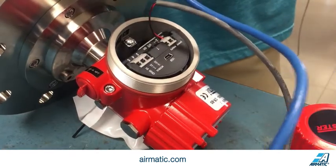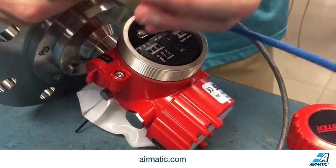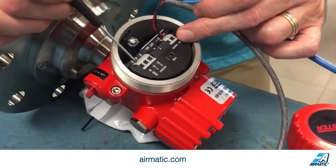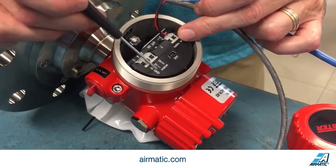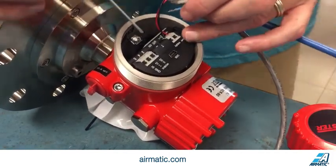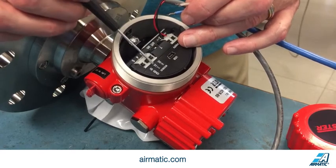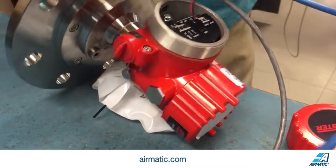This is my RS-485 cable. We recommend that the ground wire or the bare wire of the RS-485 cable is not connected to terminal number five. On this terminal block, you've got 3, 4, 5 for your RS-485 connection. Terminal five is the IS ground, and we've been told not to connect the ground. So I'm connecting my positive and negative to terminals three and four. Three shows as DO positive, four shows as DO negative. In this case, I'm using my blue wire for positive and my clear white wire for negative.